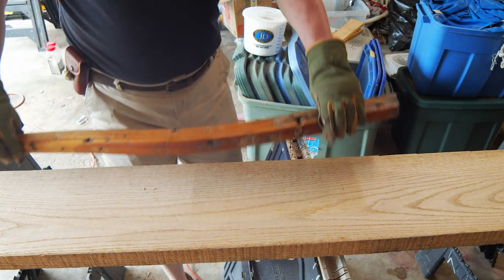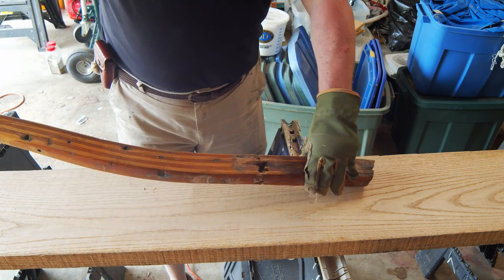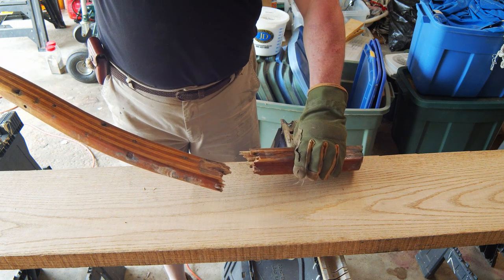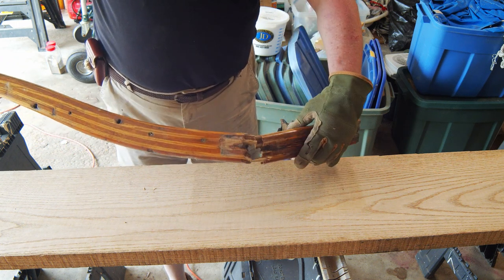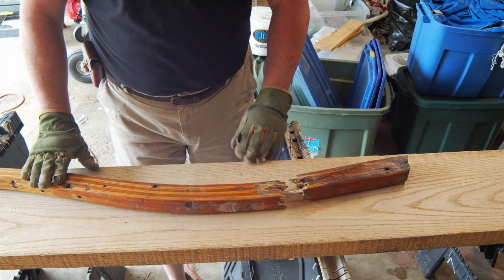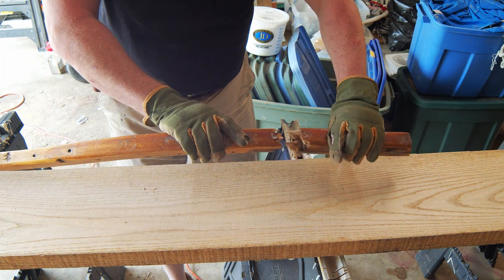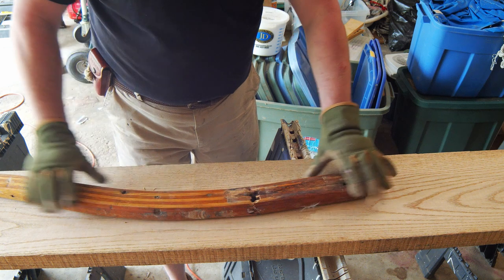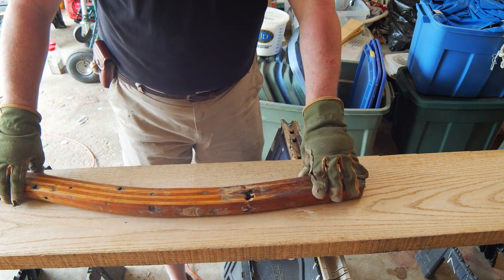At the very end of the season in 2019, my tiller broke just as I was pulling out of the dock. As I was backing out, I threw the helm over and it cracked right there at the bracket for the rudder. There's absolutely nothing like that feeling of your boat not answering her helm, especially when you need it the most. Now even though it was a laminated tiller, it failed because there was way too much drilled through it — too many adjoining bolt holes and too much water ingress.